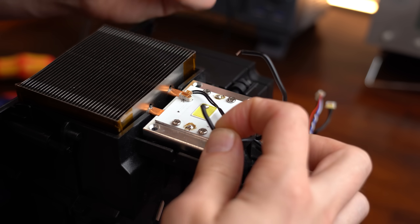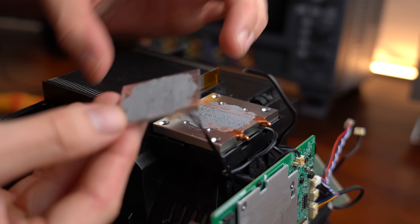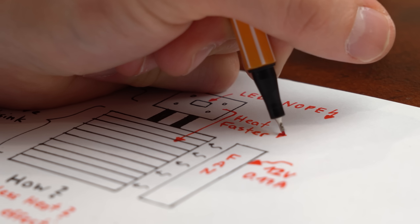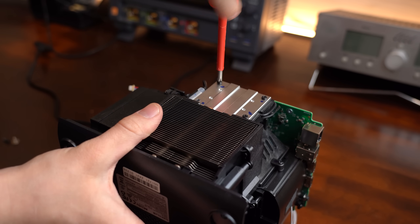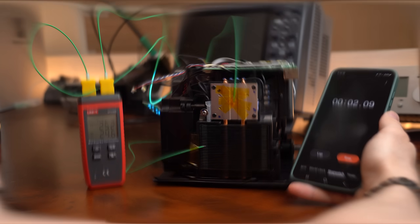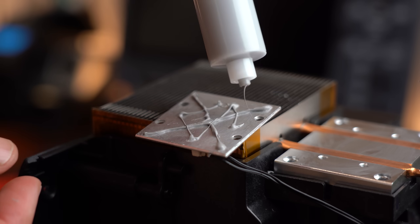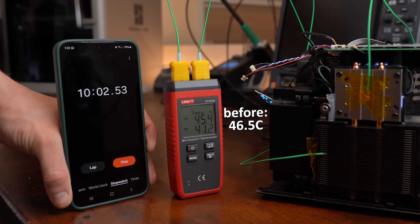The last thing that came to my mind was the connection between the LED PCB and the aluminium chunk, for which they utilize thermal paste. But it seemed rather dry and like not enough, meaning that by using a better one we could increase thermal conductivity and thus move heat more quickly from the LED to the heatsink. To properly test that, I secured a probe to the upper and lower heatsink and let the system run for 10 minutes, which gave me temperatures of around 46.5°C and 40.5°C. So I removed the old thermal paste, put on some good new one and repeated the same test, which to my own surprise lowered the LED heatsink temperature by 1°C. Not bad.